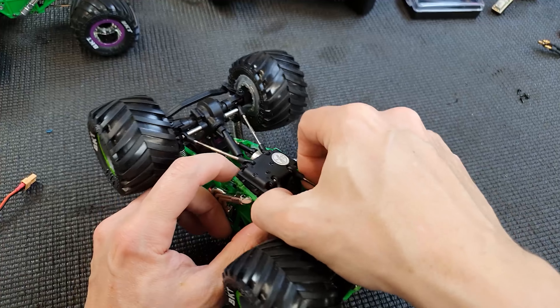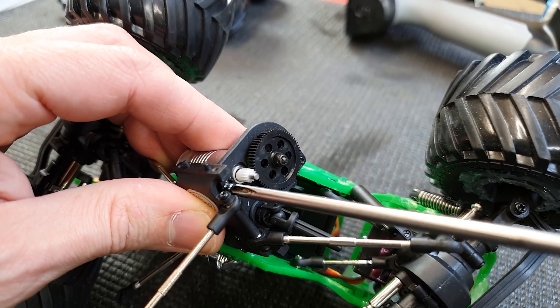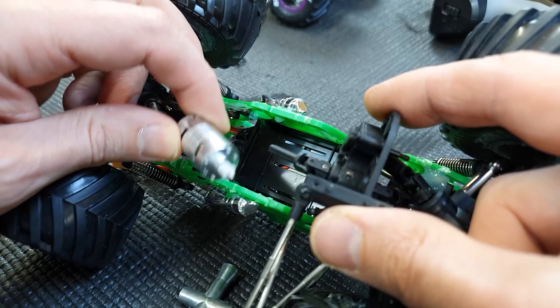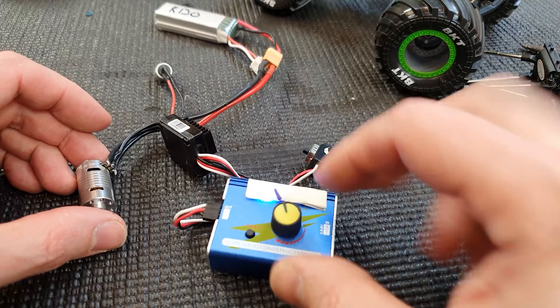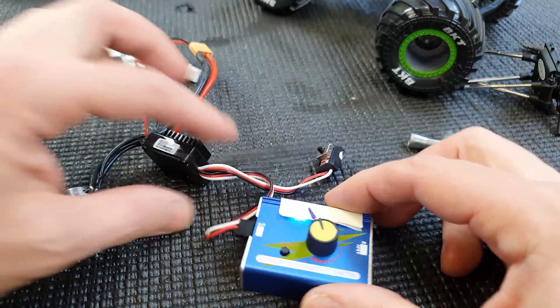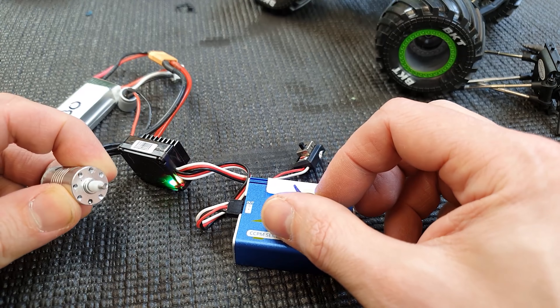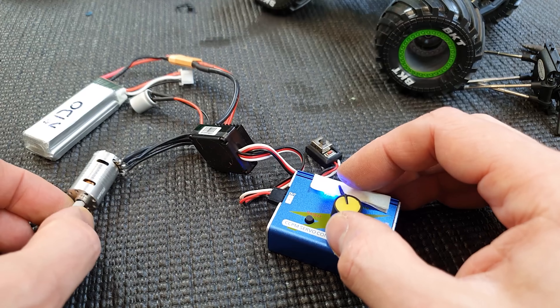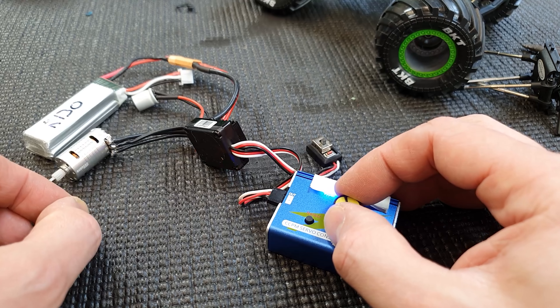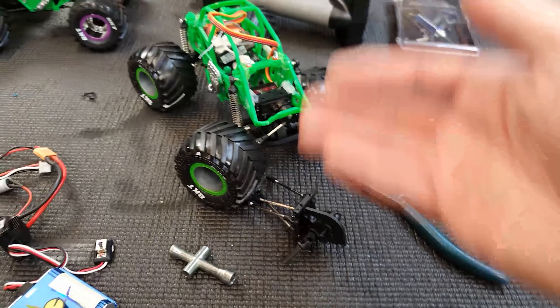Oh — it's broken actually. You can see the bit that's broken in there, but you can get this part in metal. I got the UJ back on again, and luckily on Banggood they do some metal ones, so I'm going to order those and hopefully that'll make it stronger. Next I'm going to install this motor and brushless speed controller — this one is a much higher KV than the current motor, so it's probably going to be worse, but I want to try it anyway. I'm not going to film the whole process since there are other videos in that playlist link.